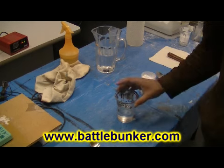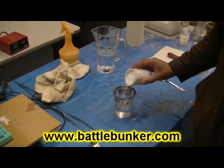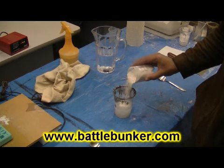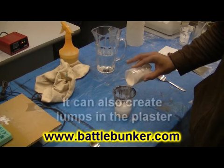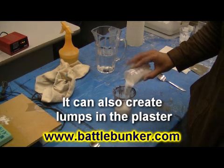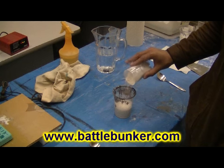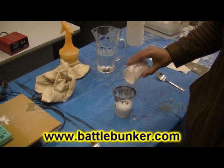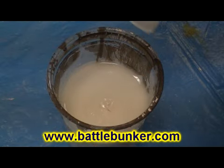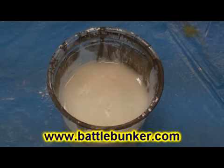Once you've got a little bit of water in your cup, you want to start adding your plaster to it. Don't dump it all in — you want to sprinkle it in there. If you dump it in it's going to create a whole bunch of air bubbles. Just gently add it until you can see the plaster start to sit just below the surface. With hydrostone I add plaster just until I can see it below the surface and just until it starts cracking.